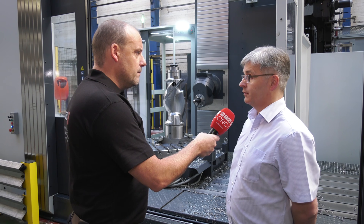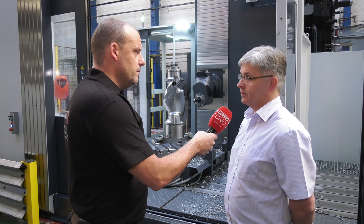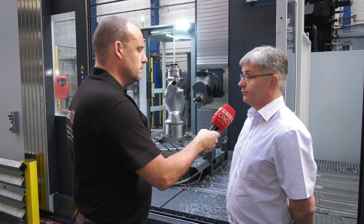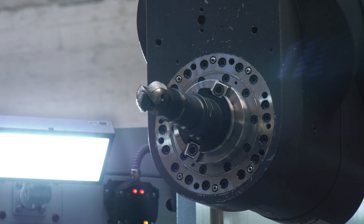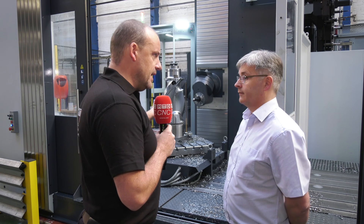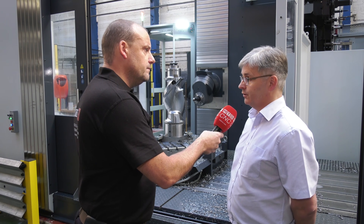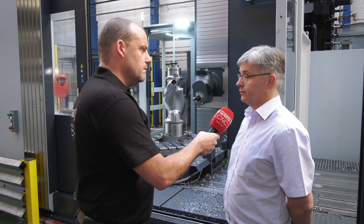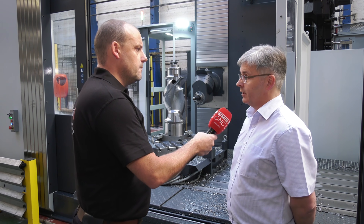The travelling column machine is actually more rigid than the Norma, because the whole column moves. The Norma L is suited to lighter machining, whereas this is a more heavy-duty machine tool. The spindle technology is a big part of Correa's pitch — it has a 50-taper head running at 6,000 RPM, the same UAD head as on the Norma L.